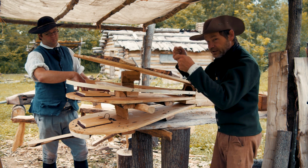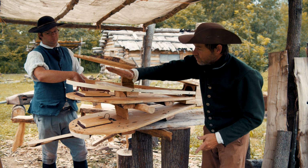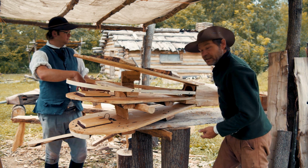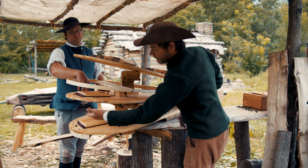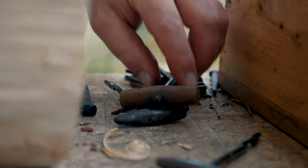And as soon as you let go again, gravity from this top section will slowly push air out of this chamber and through our nozzle in the front. And as that's happening, of course, you've let off, and this is again pulling air in. So this double chambered bellows gives you a very constant airflow.